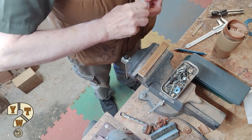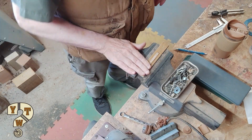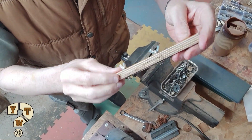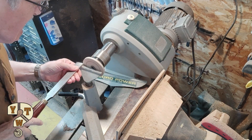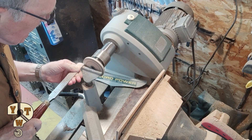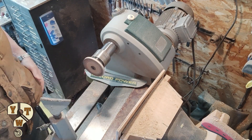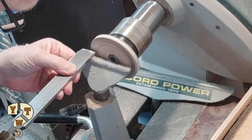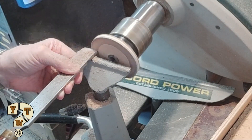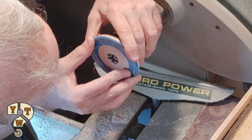Here I'm making the follower that will hold the small gear, which will then mesh with the larger gear that replaces the rosette or cam. There are two annulus gears in the spirograph set that I purchased. One is what you might call the imperial one, which has a fractional number of teeth, and the other has a metric number of teeth divisible by ten and five. So I'm just making a holder — a hub — for this.